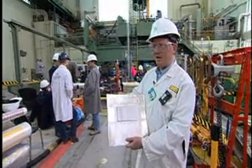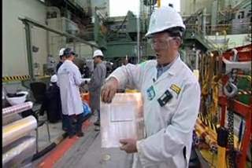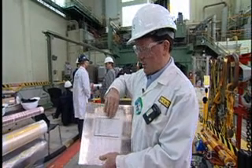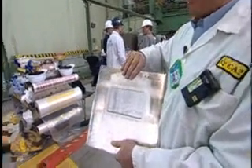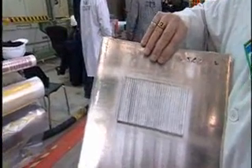The welder, of course, can't see that through the vessel wall. And so by precision positioning of the welding tool, we're adding several millimeters of additional aluminum thickness at the regions that require this repair to provide both additional structural strength to the vessel wall and sufficient corrosion allowance so the vessel lifetime can be extended to meet all of our future obligations.